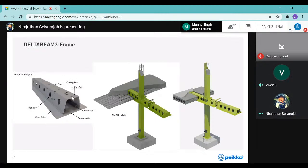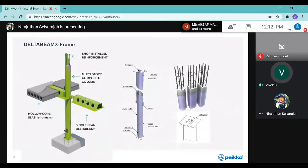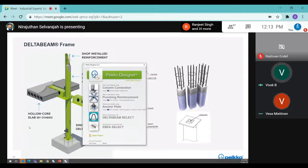Okay. And as for the seismic loading, in the software, in the bolted column condition design, actually the seismic loads are also considered. Seismic loading combinations you can also input there; normally this is exported from software like STAAD or ETABS. Is it response spectrum design or can we go for a dynamic, like nonlinear time history analysis or anything of that sort? No, this software is only for static linear design. Okay. Thank you for the clarification.